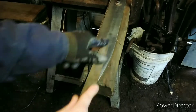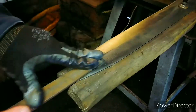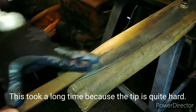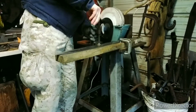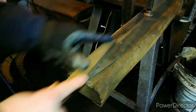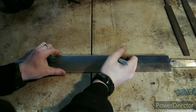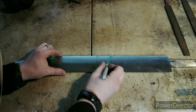I'm also going to file on the tip because the tip is thicker than the rest of the blade. The reason for that is when you forge it in, it gets chunkier towards the end where you put in the tip. So now I'm going to have to work on that because I didn't forge that out — I'm going to file on both sides, get them even, and sand back in the center line. I'm also going to draw lines and arrows across the blade for the high spots so I can work those out with the belt sander.